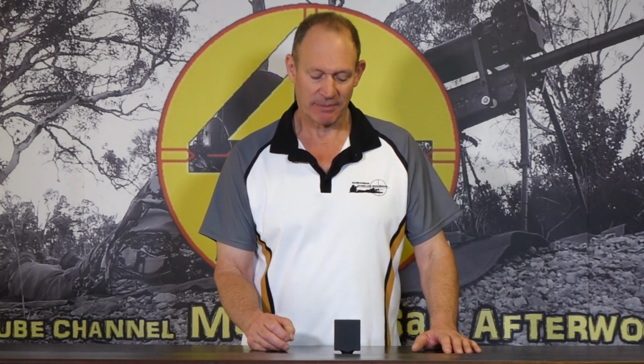They come clean, they're not coated, and we don't do the threading here. We've set it up so you can get it to your gunsmith and they can cut the thread to suit. It doesn't need to be a gunsmith. It's obviously just a thread and finish in the end, so any good machine shop can do this, and it is simply that thread and maybe necking down the flange point so it can meet up to your muzzle exactly. So fairly simple machining that can be done in your part of the world without too much fuss. So that's about a list of them.